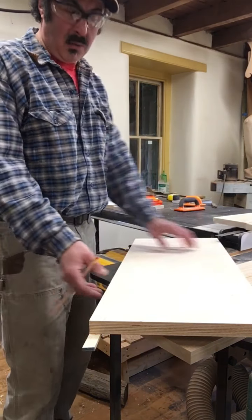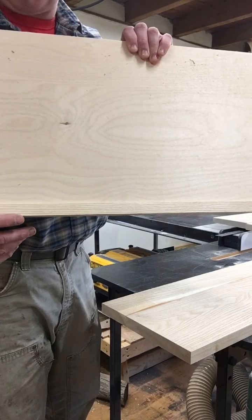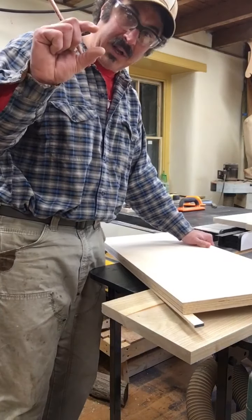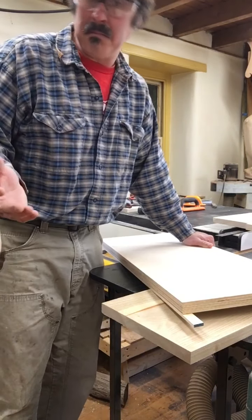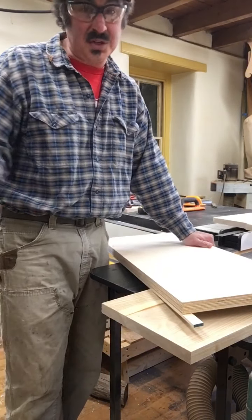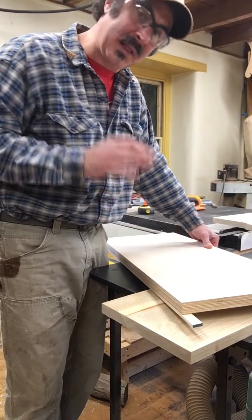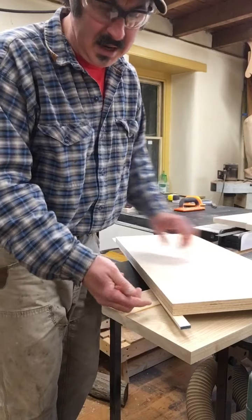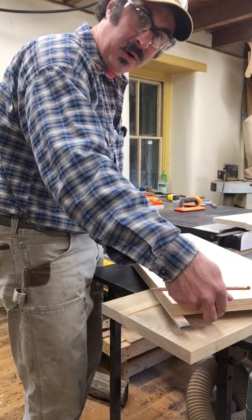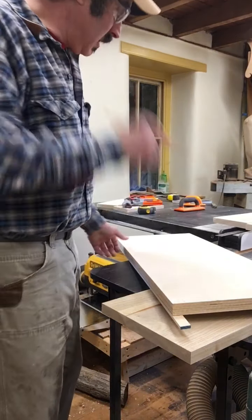Okay. So what I've done is I've glued a little strip of 1/4 inch. I just hot melt glued it because right now it's a 1/4 inch, which means that I'll have 1 inch thickness and 3/4 inch thickness on the other side, maybe. But if it turns out that my math wasn't right, which is very possible, because that's over the width of this 12.5, and that's 10.25, so it's probably a little bit less on that. But what I could do then is take this off with a putty knife, pop off where the hot melt glue is, and then push this forward, and that'll give a little bit more incline, so I'll get a little bit of an increased taper. So let's see how this works.